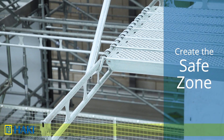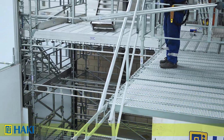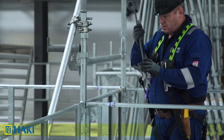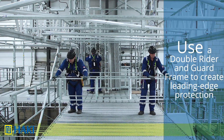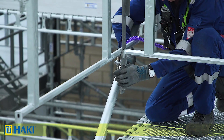To create our safe zone, we put two guard frames at the sides first, using a 305 ledger beam to support the back end while the second person fits it into the pocket. Then to the two side guard frames we attach a double rider, then put a guard frame in it, creating a leading edge. We then slide that along until it comes above the stiffener on the side ones and tighten it off.